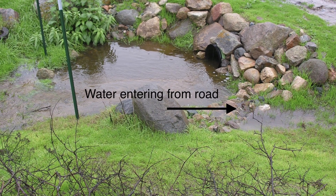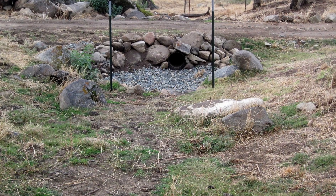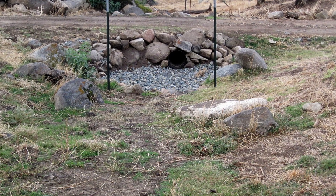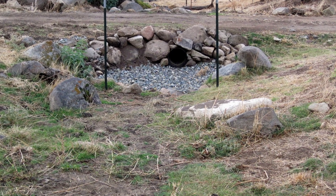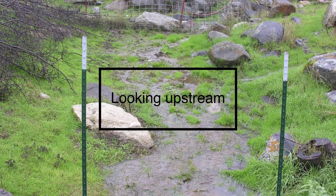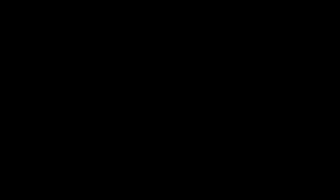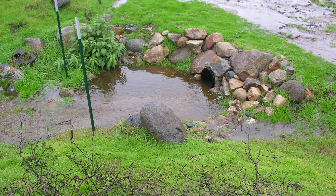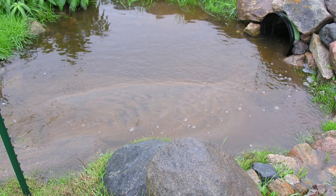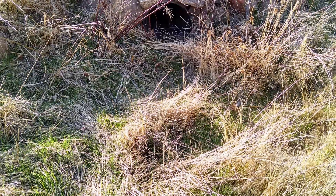The keyed-in rocks on the side of the pool that receive runoff directly from the ranch road form a minor pour-over lip that protects against erosion from that direction. This is the finished entrance viewed from upstream, awaiting the first seasonal rain that will stimulate plant growth. Here are several views of the system three months later after significant fall rains, and finally three years and three months afterward.